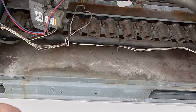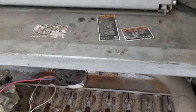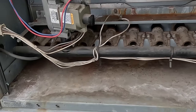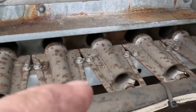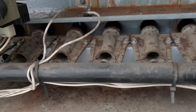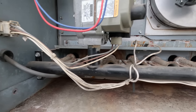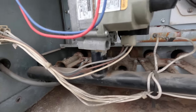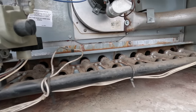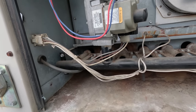Oh, smelly, smelly. All right, let's watch this happen again. The spark module must be working but we're only getting a little bit — probably a couple of flames across, definitely not getting down to the flame sensors. Look how those left chambers are pretty much burning now. They even said themselves they thought maybe it'd be the heat exchanger. We got three of them lighting — yep, heat exchanger. That's it.